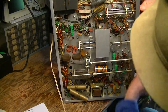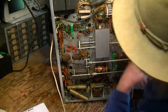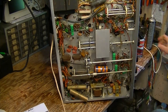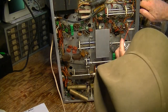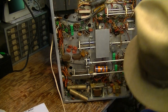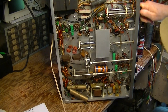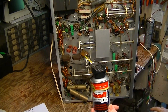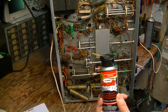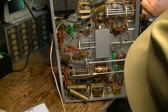There are three ceramic switches on one shaft and there's a little ball detent buried way back in here. You don't want to get this lubricant on the switches. The only thing you want to get on the switches to lubricate them is the Deoxit. This stuff does lubricate your switches and your pots, but it also removes corrosion and leaves a nice little conductive film on your switches.